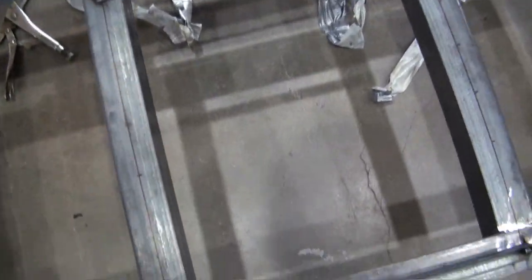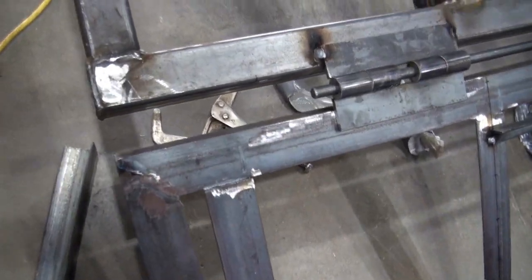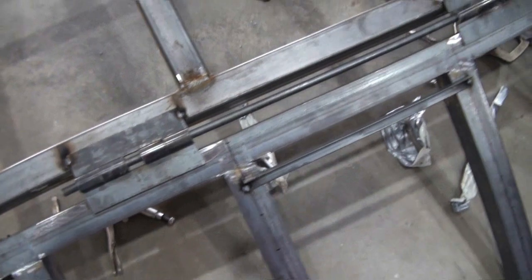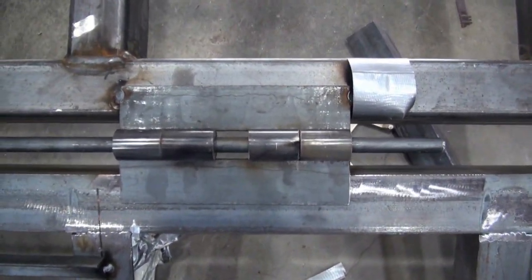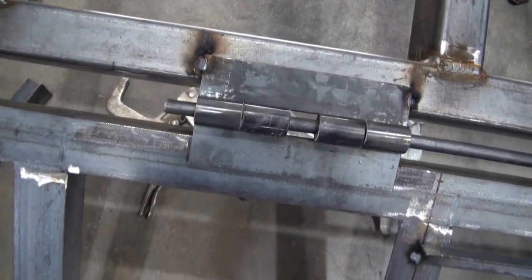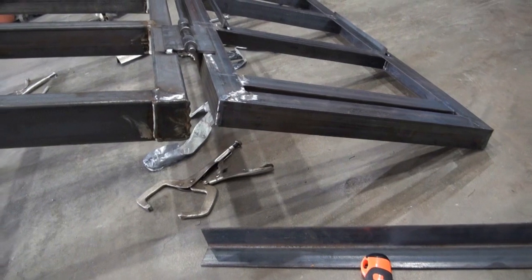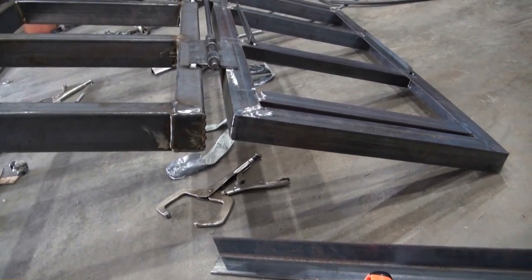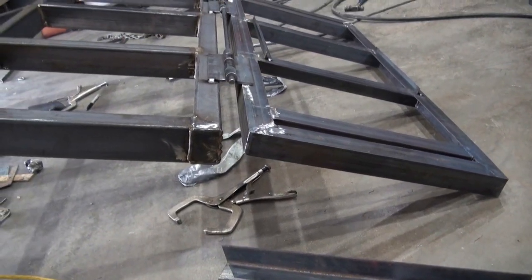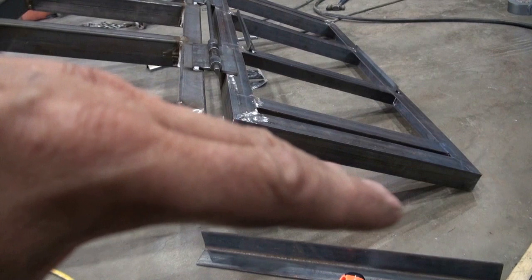Okay, let's see what happens. That's actually plenty of room now — it increased the gap a lot. That's a pretty heavy duty looking hinge. It actually makes the fold-out ramp longer in a sense. When it extends out, it's as though it's longer because of this gap, and that actually reduces the angle down. When it's shorter, it has to tilt down more.